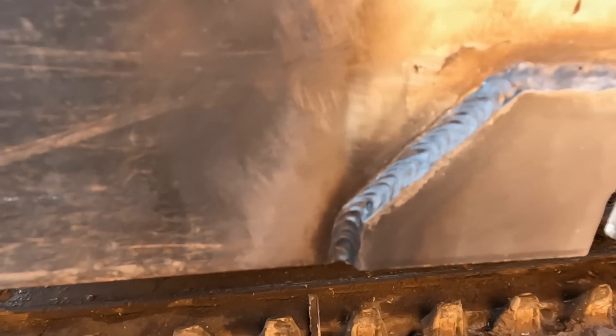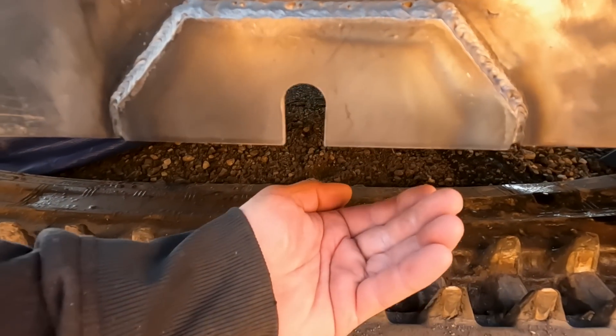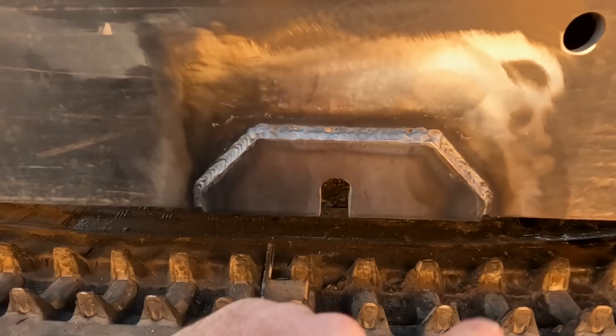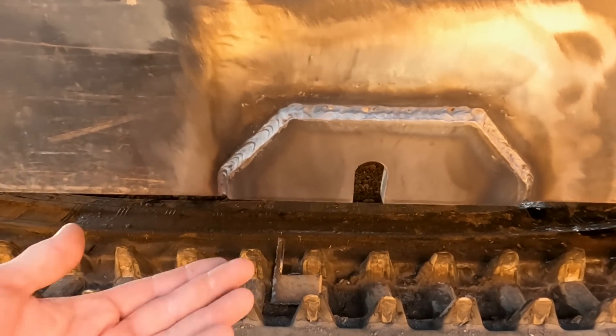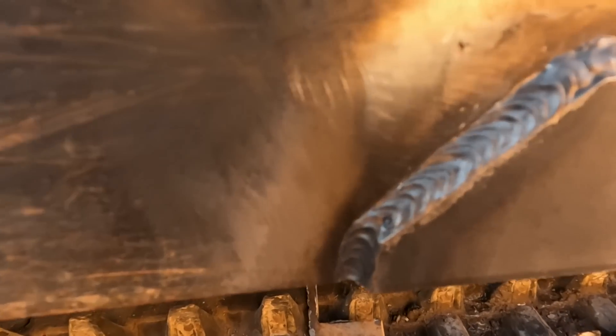This is what it should look like when you get finished up. They don't recommend welding across the bottom — just around the outside — so that's why I make them flush. I'm not worried about welding across the bottom. Anyways, that flux core does a pretty good job welding across there.